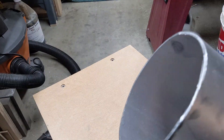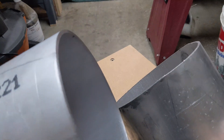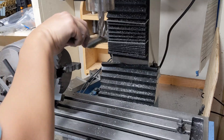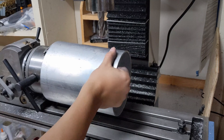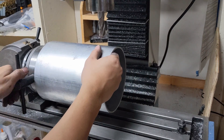Considering what we're starting with — this bandsaw cut — I think what I got is much better. I'll start with a rough cut on the bandsaw; it doesn't have to be very accurate just yet. I chuck it onto my rotary dividing head, placing it just past the OD jaws. It's not going to be perfectly accurate, but it does force squaring off the edges.